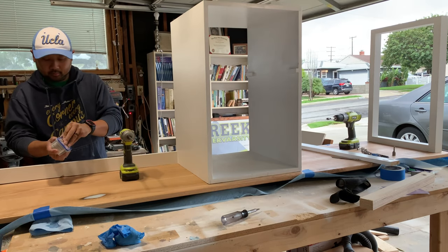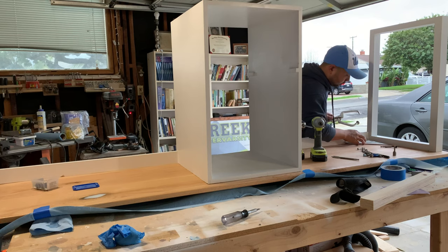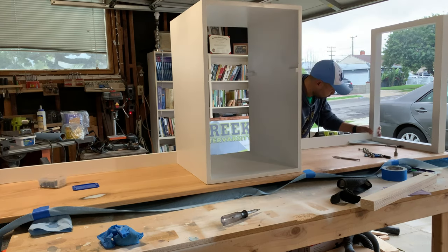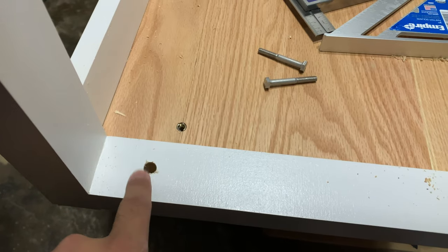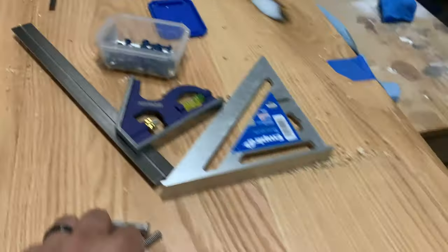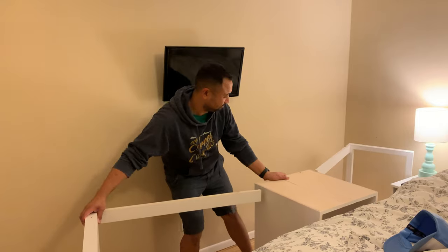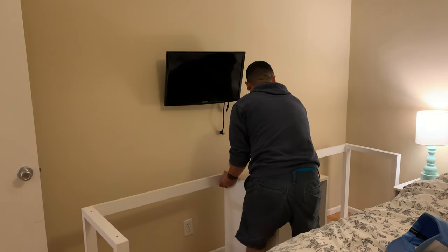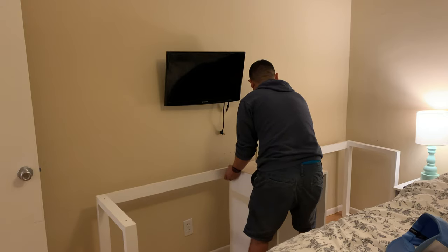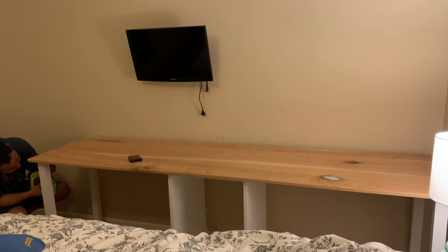Once the base and the table were both finished it was time to assemble everything together. Here I am assembling the shelf and the legs with pocket hole screws, using a square to make sure everything is lined up right. Then I'm inserting threaded inserts into the bottom side of the table. I'm going to use a spade bit to countersink it a little bit for the washers, and screw in these hex nuts to attach the legs to the table — two in the middle and two on the other side. I moved everything into the house, reassembled the base with the pocket hole screws, moved it next to the wall, and then my wife helped me move the table inside. Last step was to attach the table to the base and install the shelf.